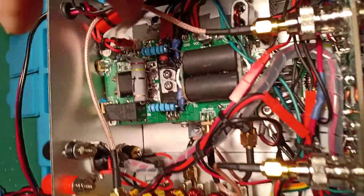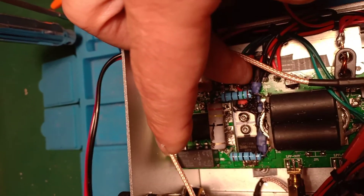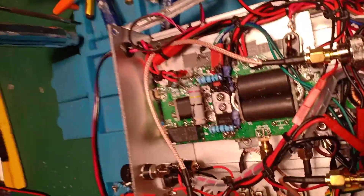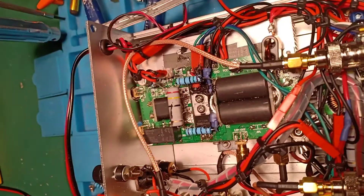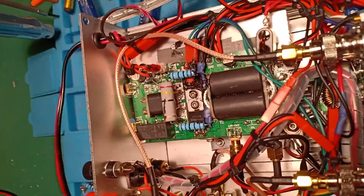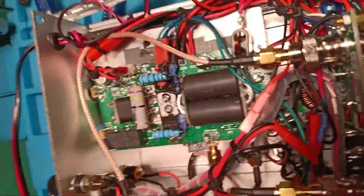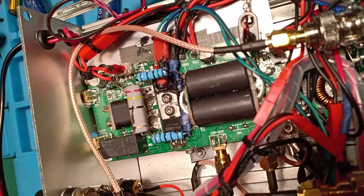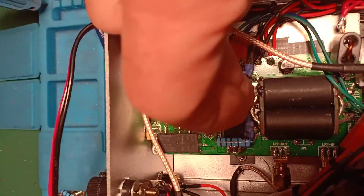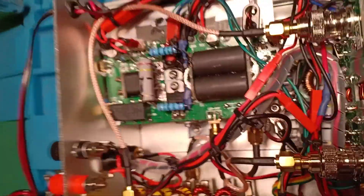The other feature is to add diodes. I implemented six diodes here, placed very close to the two MOSFETs. Silicon diodes whose internal resistance changes with heat — it's a very efficient feature. In fact many professional amplifiers use this modification, and it also helps protect your amplifier.